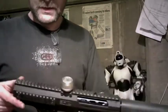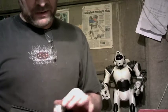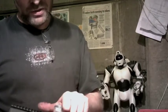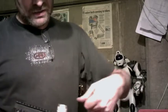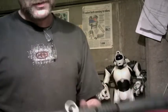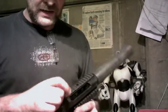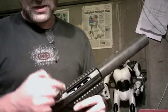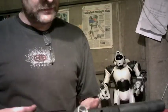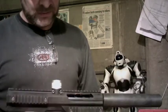There's your second one. The feed neck on this one is silver. Now these are a real arse — I wish I hadn't used these now, because when you've got your hopper on you can't get in there to tighten this ring up, and this ring has to be really tight. So you're going to need a monkey wrench or something. Before you put a monkey wrench on there, put a bit of tape around it and it will stop the monkey wrench from scratching the alloy. I'll see if I can improve this somehow, but now of course they're set in — I can't take them out again. They're there for life.